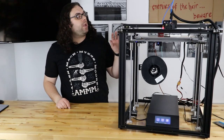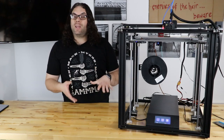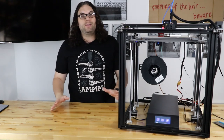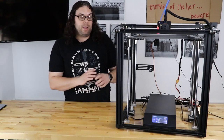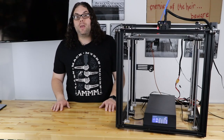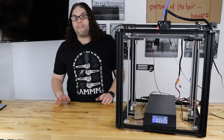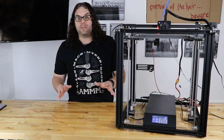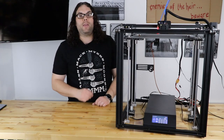Don't forget — we put a brand new extruder on with a different gear, which means you're going to have to recalibrate your E-steps and probably the flow rate. You can see the video I did for that; I did it on an Ender 3 but it'll be the same, and you'll need a computer to store the values. You also need to go through the leveling process again, since we completely changed the bed from glass to the TH3D EZFlex system. We also put a brand new board in, so the Z-height we had set is completely erased — start from scratch, run through the bed leveling process from the manual, and then you'll be good to go.